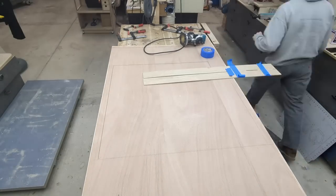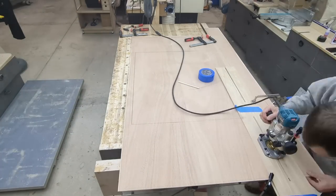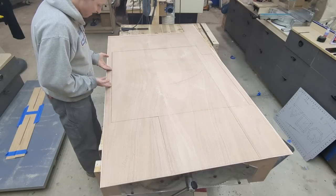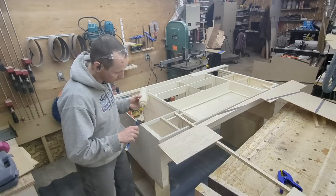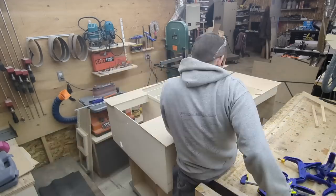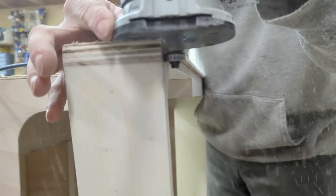This time-lapse footage is from well over an hour I spent making this cutout. The little spacer blocks I use to keep the track the right width, I also use as end stops so I don't cut too far when using the plunge router. Eventually I make my last cut and then with the help of a handsaw the center piece is free, and then I can work on gluing this outer piece to the cabinet. Next morning I remove all my clamps and then quickly with a flush trim router bit I go around the outside and trim all the edges perfectly flush with the cabinet.